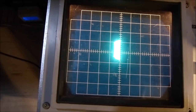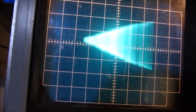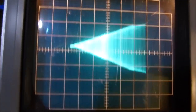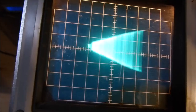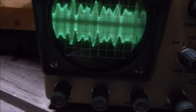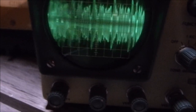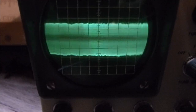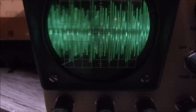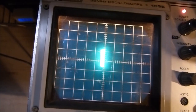Let me turn it back on to compare. You can see that left side still has some vertical deflection — I'm still talking loud intentionally trying to over-modulate, and looking back at the simple RF sampling, it never goes to that little sharp bright point of over-modulation. I know sometimes there's a sync problem between the camera and the modulation pattern, but it works. This seems like a minor detail but it's actually very important — you must never over-modulate in the negative direction.